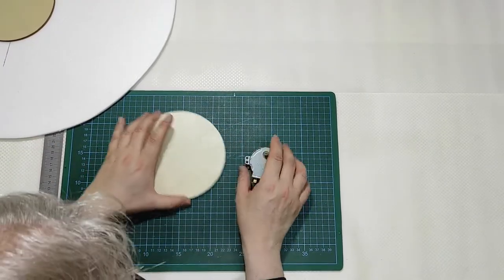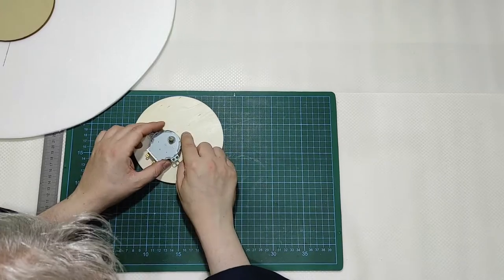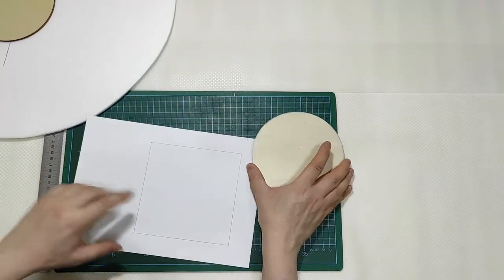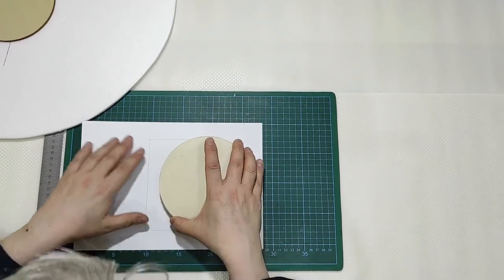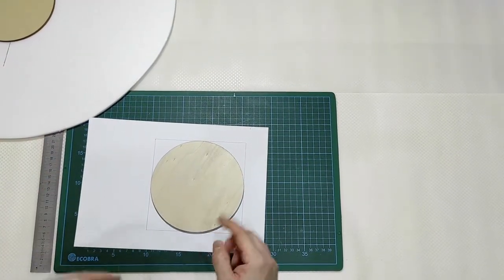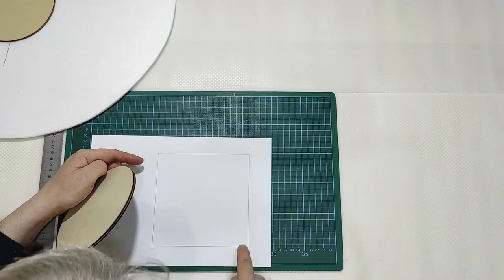I will need to fix this underneath it and to have a hole big enough to have the stuff here getting through, allowing also a means of transmitting and joining the movement between the motor and the platform. Those circles here are 15 centimeters in diameter. A diameter of 15 centimeters, okay, but a circle can be inscribed inside a square. Okay? Why did I do this? To find the middle and to have it drilled. So I have here my 15 by 15 centimeters square.